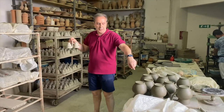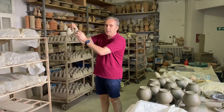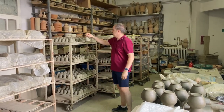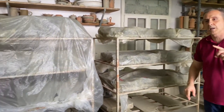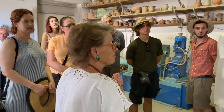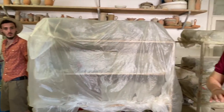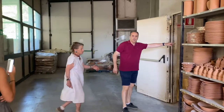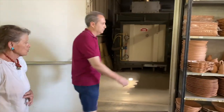When some days for drying, you can see the darker color of fresh pieces and the lighter color of dry pieces. When pieces are like those, they are ready to go into the kiln for the first firing. The first firing takes 26 hours: 12 hours to reach the maximum temperature of 1020 degrees Celsius, and 14 hours to cool down. That's very important to avoid breakage. That's why we advise against putting these pieces in the microwave — dishwasher safe, but please avoid microwave.